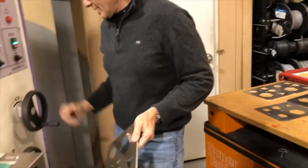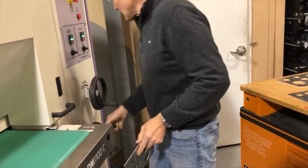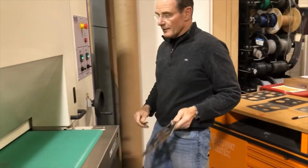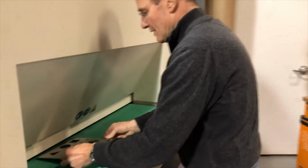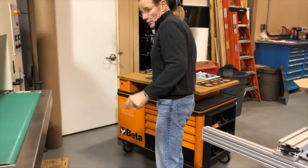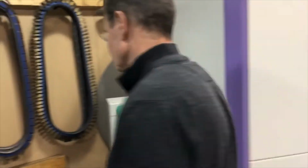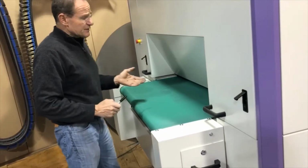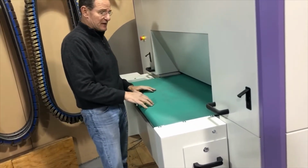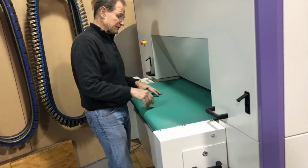Stainless, and again, we're just going to go thicker here, the 3 again. I'm going to go a little bit heavier into the belt, I can afford that, and then we're going to go back to 2 feet a minute, and we are going nice and parallel to the belt, with a cross belt. On these materials, your consumables will go up, maybe to $4 per hour or things like that, because you have more interaction with the edge, and especially the material is sharper and harder, so it uses a little bit more pressure.